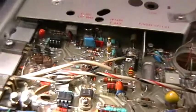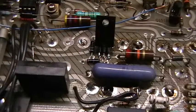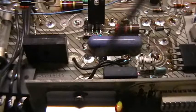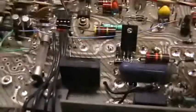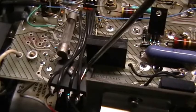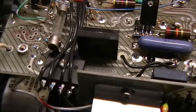The other problems that had been caused were, as I said, the failure of one of the capacitors - which you can see where I had the jumper across the ground leads where I had removed the original can capacitor and put in place a computer grade one. And one of the rectifiers had completely died. I was worried about how much current was going across it, so I put in a quite a bit more substantial unit and used jumper wires to go to where the old one used to be. That way I know this one here isn't going to have a problem with the rectifier failing from too much current or too much heat.